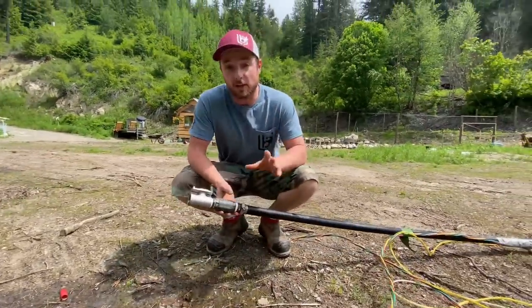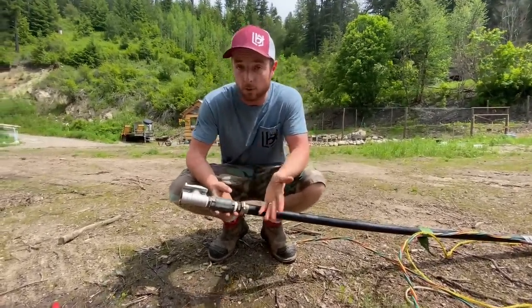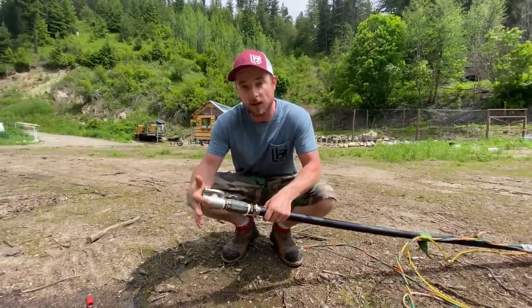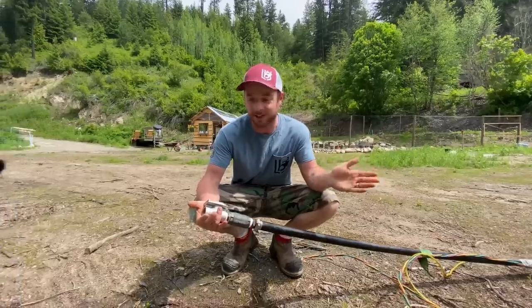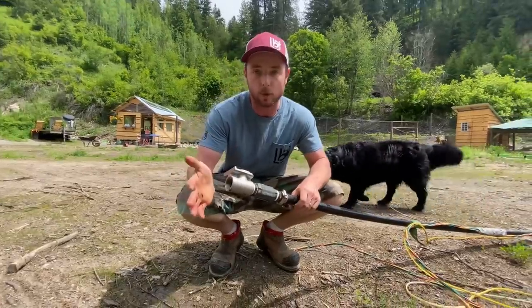So there is a check valve at the very top of the pump, as well as a check valve right here on the downside of a pitless. This is just our pitless, guys. This allows the well to be removed without digging up your water line. You know, that pitless sits about 4 feet down beneath the earth. So this is just a simple device that holds pressure and lets you remove everything.